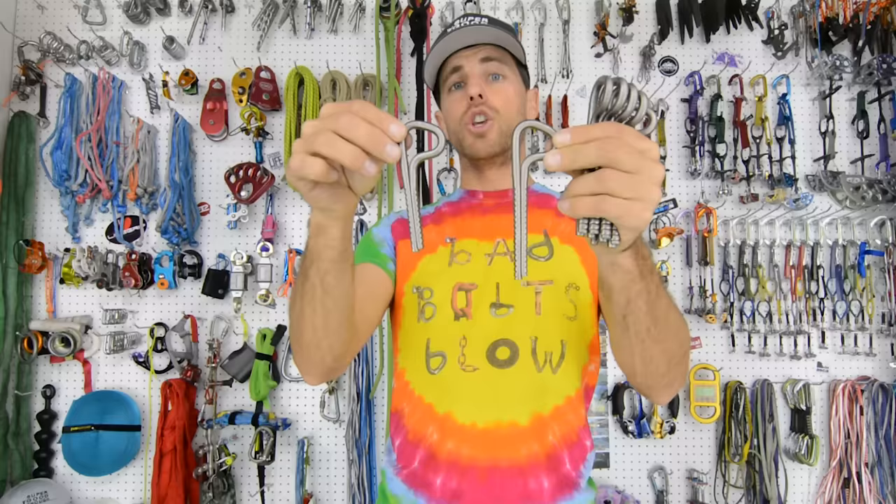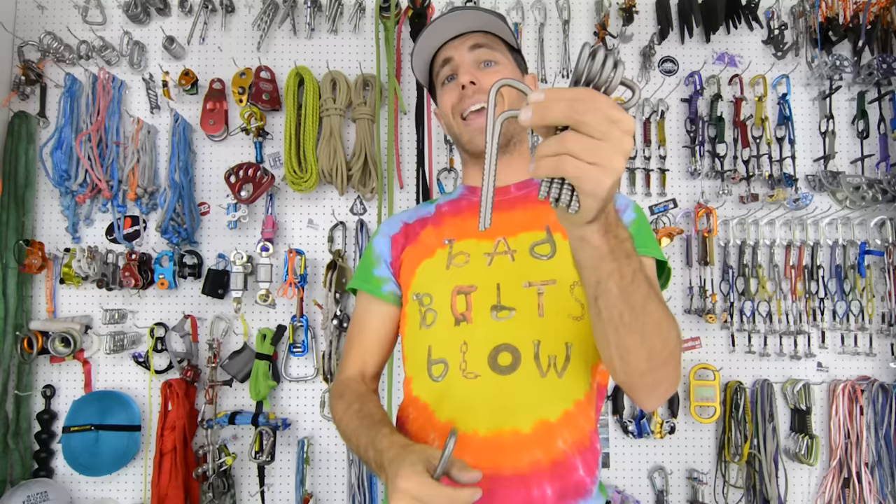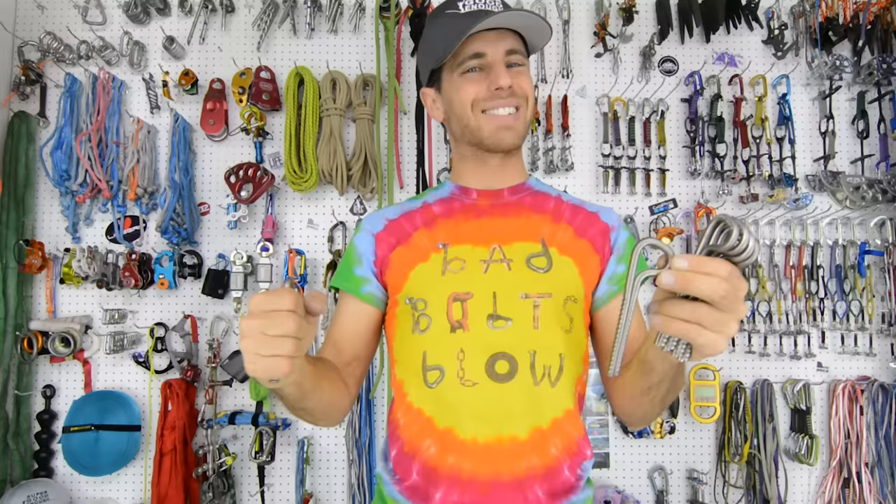You can see here that they come in two different lengths: 80 millimeters and 110 millimeters. What we tested in the granite was 80 millimeters and as you can see when this part is breaking it doesn't matter how long it is. But if you're going to install in a softer rock or a layered rock you would want to go with something longer — it gives it a little bit more to grab onto.